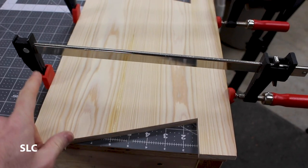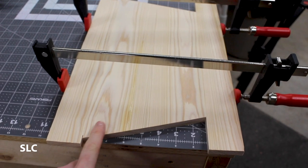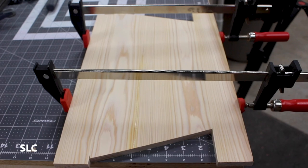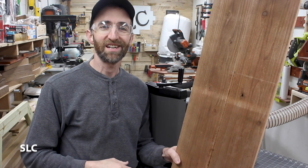After I added the glue, I added a couple of clamps. I made sure to use some sacrificial board pieces because I'm trying not to mess up these edges, but overall that should fix it after a good sanding. Now I'm going to run these long dark boards through the planer and hopefully we won't get any cracks in these.